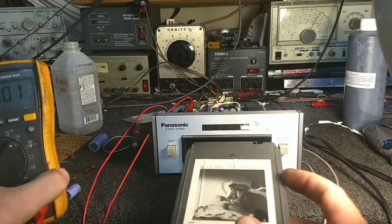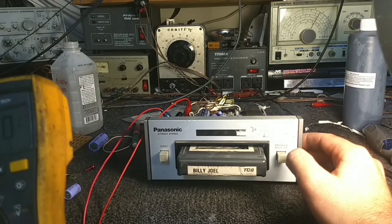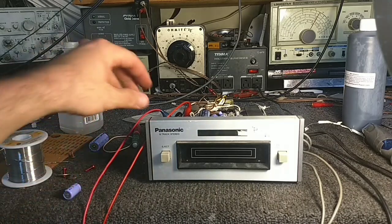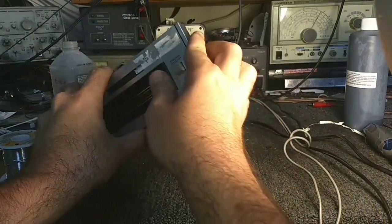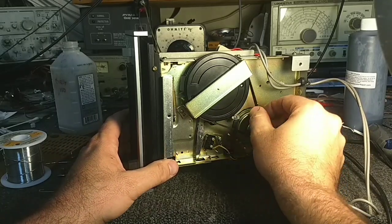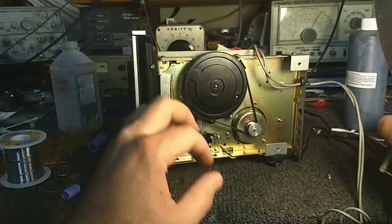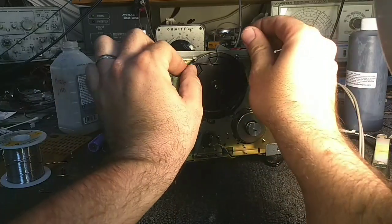Let's shove the cartridge in again. Yep, so quick change doesn't really hurt it all that much. But I notice initially it is a little slow to start, which I'm not really too keen on. So it may be that this is a little bit too snug. So maybe we do need to go back to the 12.4. Still have that nearby, so let's just go ahead and do the 12.4 and see how much better that behaves.